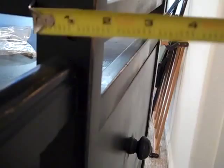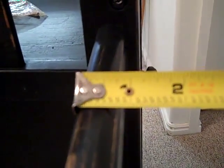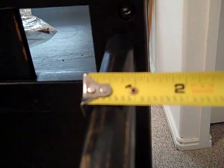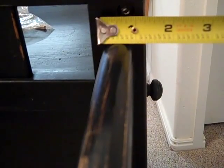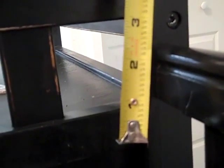Right here looking at an inch and a half. The rail itself is three quarters of an inch wide, so you probably want to just cut a little block that'll fit right there - about an inch wide by maybe two and a quarter inches tall, an inch wide, two and a quarter inches tall, and a half inch thick. We just need one, two, three, four of them.